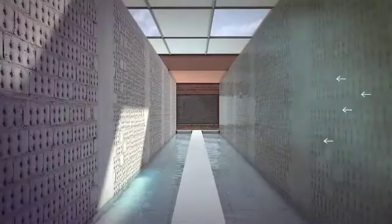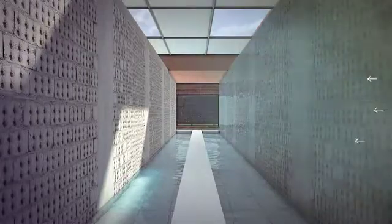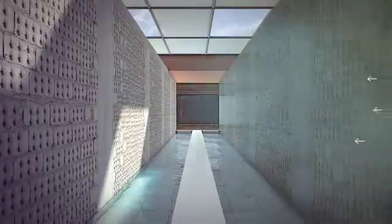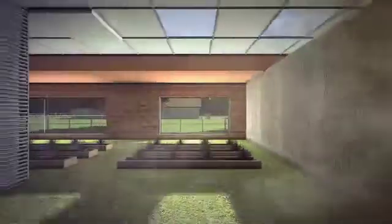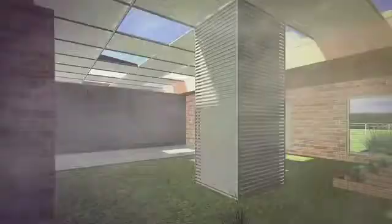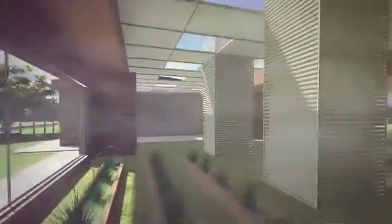The first wall is a liquid desiccant cooling wall that's designed to remove humidity from the incoming air. After the liquid desiccant cooling wall is another wall, which is also made of the Pozzolan bricks, that is supplied with the seawater or the brackish water. And that uses evaporative cooling, where the temperature of the incoming air is reduced via evaporation of the seawater, so that it's in a temperature range that is much more favorable for plant growth.